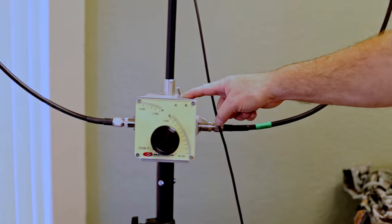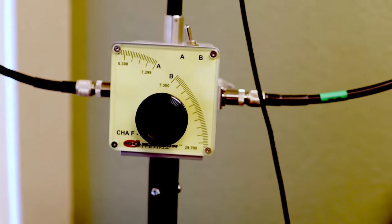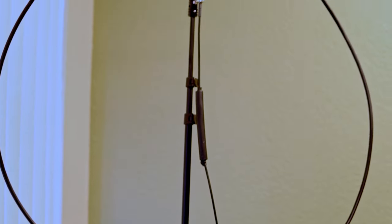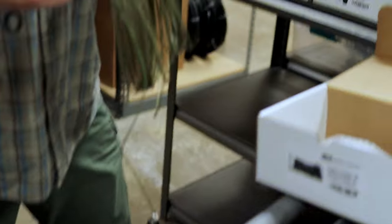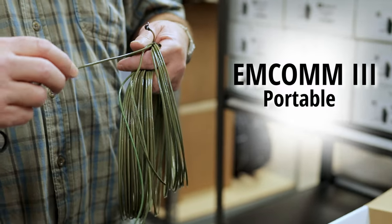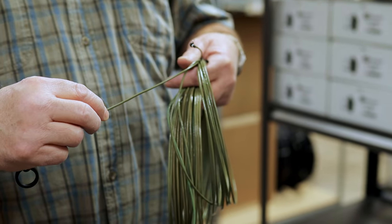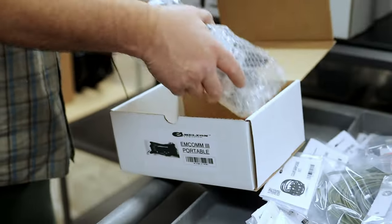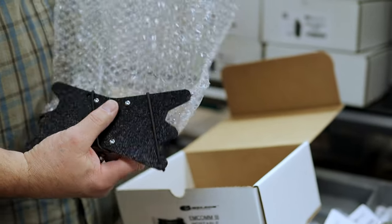This is our antenna — this is the 2.0 version of the F-loop. The 3.0 version is a different enclosure. The jacket is Teflon and is rated for 50 below, so it won't crack in cold weather. 100 watts? No, a lot more than that. Out in the open, it might be good for legal limit.